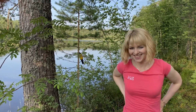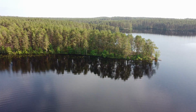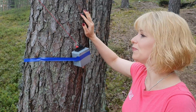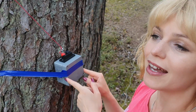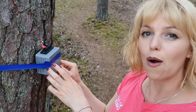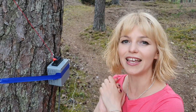Antenna. My antenna is on the air above the lake, and it is the end. It is an end fed antenna. This is the end of this antenna, and this magic box helps to transform from 3,500 ohms to our usual 50 ohms. And this box was made by my very good friend Alexei,